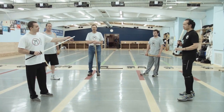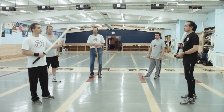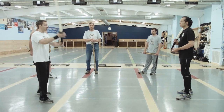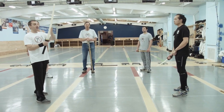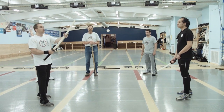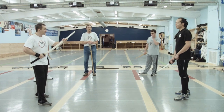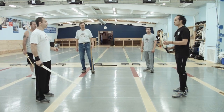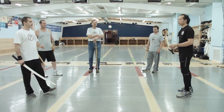These sides, though, are softer and more flexible. The reason for that is when I cut in, when I'm driving through — that right hand pushes in, that left hand cuts — there's a lot of pressure going through that blade. You need the back to be flexible enough to sort of bend instead of shattering. The edges are around 60 Rockwell, and the spine and back could be as much as 10 or 12 Rockwell under that, around the upper 40s to 50s.